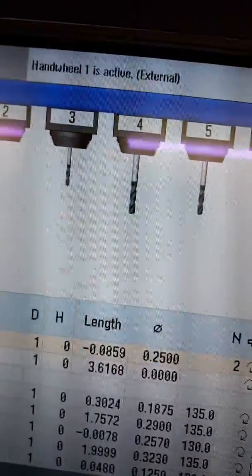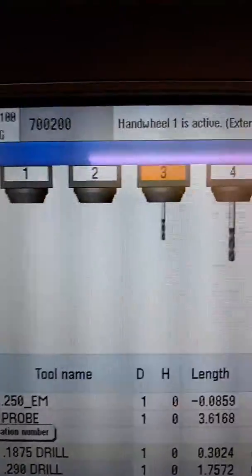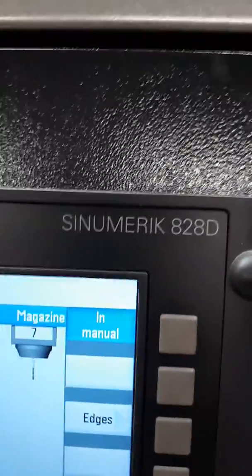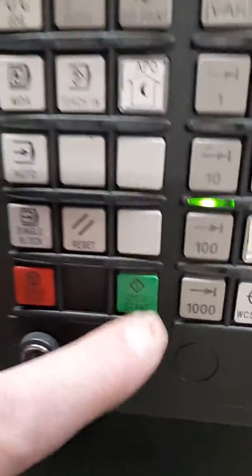Select the tool — you can pick any of the ones. Right now I've got a 250 end-mill in there, but I'll come down here and pick one of these others. So that's a drill that I've chosen. Then up here it says In-Manual — top right-hand key, push In-Manual. Then you've got to hit the cycle start button down here. It will go in and do a tool change and pick that tool up.